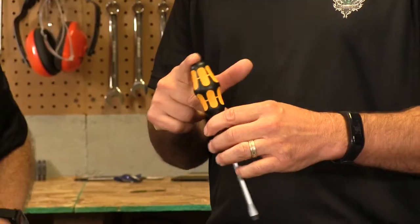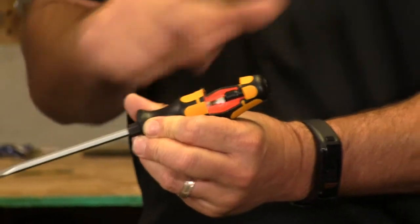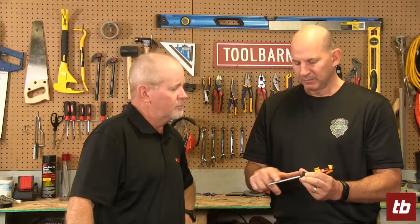Black and yellow signifies that you can strike it. So this is our 900 series, the chisel driver series — made to be hit. You have a metal cap to the blade, so when you strike it, it maximizes the strike and shoots it through. This is a special tempered blade, so it won't chip or crack. There's a bolster on it to use for a wrench, so it's a rugged screwdriver that can be used on any surface, with a lifetime warranty as well. It does perform a lot of the work of a chisel — absolutely, that's why it's called the chisel driver.